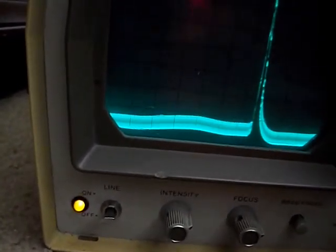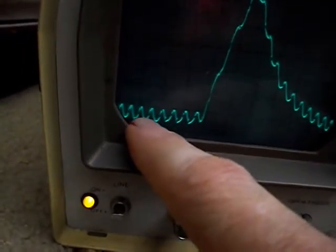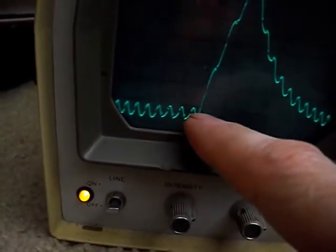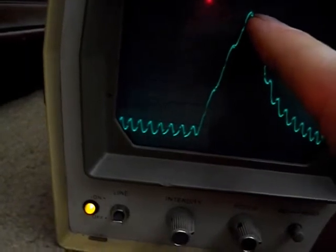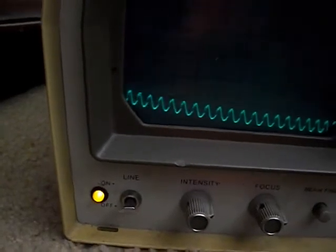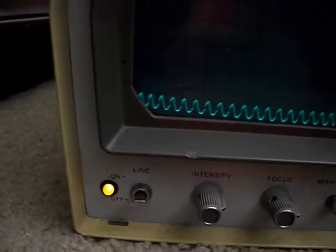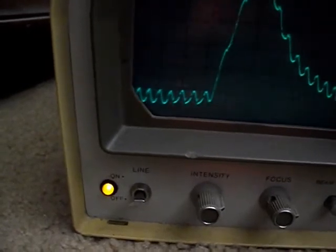These are the horizontal pulses spaced pretty far apart. They hit the integrator and start charging up a capacitor, and it doesn't have a chance to discharge, and it makes one strong vertical pulse. So that's what you should be seeing. These are not video — they're horizontal pulses with no variation in them whatsoever. They're just the unintegrated horizontal that occurs between each line of video information.